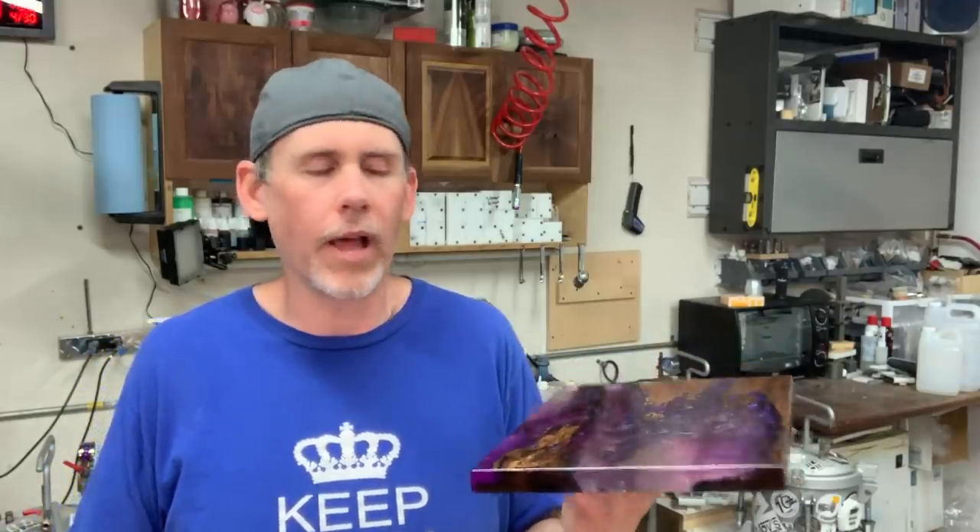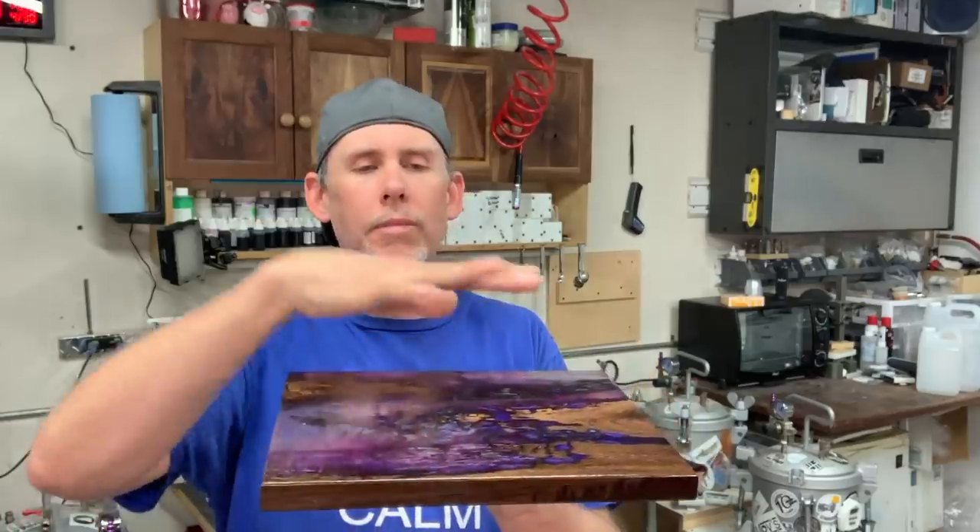I think these are more decorative — better off being more of a decorative piece anyway. Now that there's lacquer on it, once that fully cures, it's inert. Most of your top coat finishes, once they are fully cured, they're inert anyway. So I really wouldn't feel bad using this as a charcuterie board — not juicy foods, you know, not cutting tomatoes on it, but things like crackers, cheeses, and meats. I don't think there would be any problem with that. Another thing you could do to avoid the food contact issue is just make it like a serving tray — put some handles on it and serve plates of food that way.